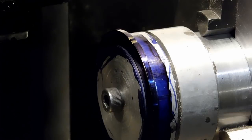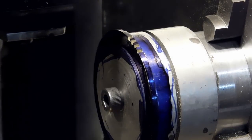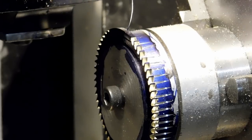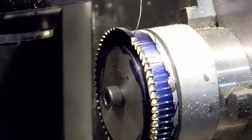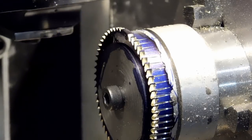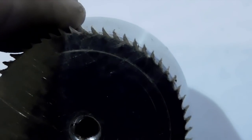Back down in the cellar — that blue section is a little bit big so we need to make our cut a little bit deeper. I'm slowly making the cutter deeper each time until I get to the depth I want. I'm using a super glue arbor this time, but it's got a big washer on the front to hold it all in place. This cut, even though it's to full depth, is much smaller than the other one, so the super glue arbor with the washer seemed proper for this one. Now coming up on the end — there's the final cut and a good look at the tooth formation on this one.